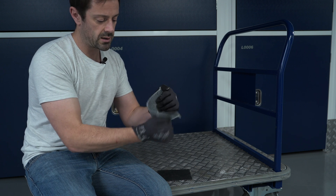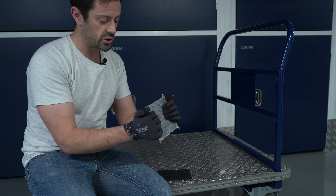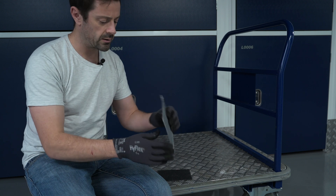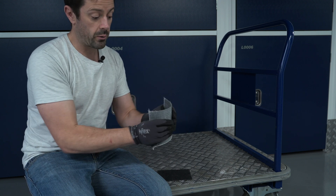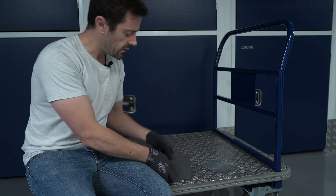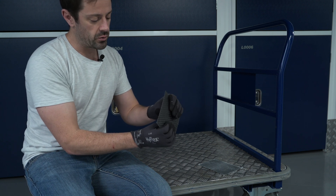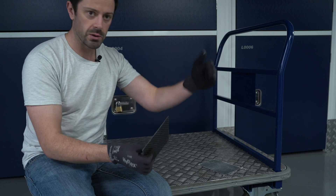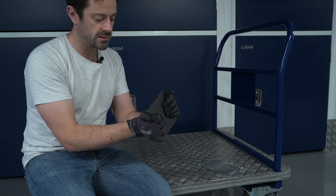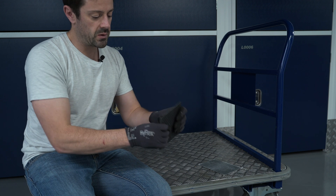This one is incredibly flexible — you can hear the slightest noise of a few carbon fibres starting to complain. This was woven carbon, not unidirectional, so it has strength in two directions: 0 and 90 degrees, not triaxial. What you end up with is a very flexible laminate which pings back into shape again, but it lacks stiffness. This second one, same components but put together differently, is massively stiffer, because you've got those carbon fibres on the outside almost fighting each other.